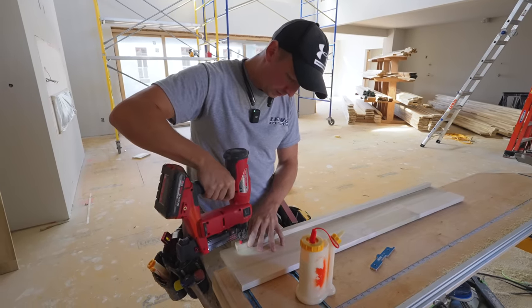There was one area with a pretty good hump in the ceiling where I had to cut a little bit out of the top of the one-by-eight. I use a laser up here, but it's always a question of whether to make everything perfectly level or follow the contour of the ceiling — the answer is a little bit of both. If this bulkhead were a quarter-inch out of level and I put the board in level across, that would create a really ugly reveal line. For the most part this ceiling was very close to level, so I used the laser as a general guideline throughout the build.